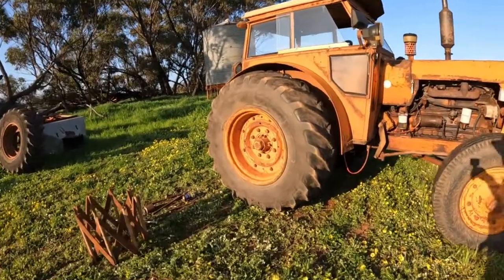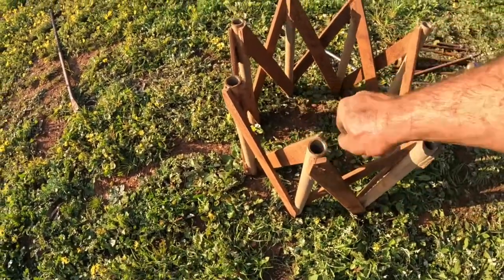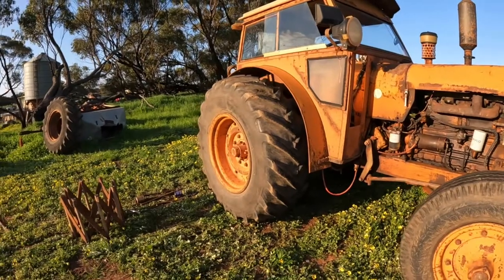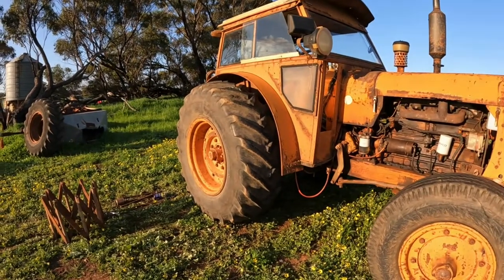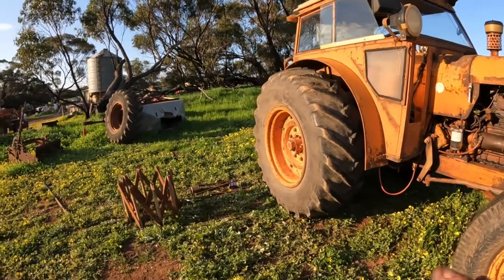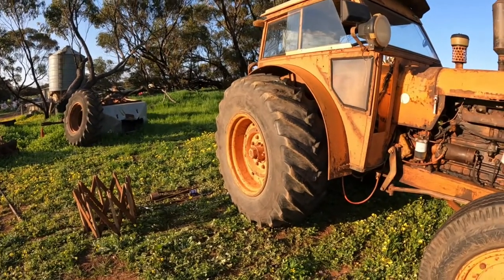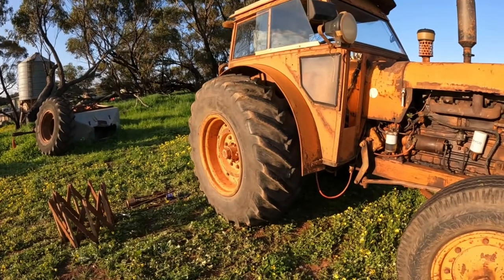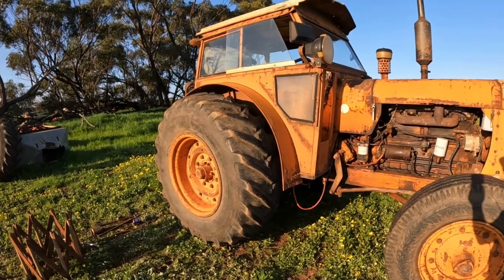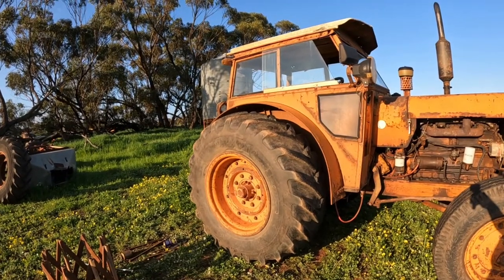So there we have it — the dual wheels are off, and all the short bolts are back in the wheel. Here's the extension frame. Why do we bother taking the dual wheels off? It makes the tractor a lot wider with the dual wheels on — it makes it harder to get through gateways and in and out of the shed. When you're cutting hay you tend to run over a lot more of the hay, because even though your hay mower is swung out away from the tractor, the dual wheels stick out so far that you run over and wreck some of your hay. It also uses less fuel when you take the duals off — not by much, and this isn't a particularly fuel-heavy job, but every little bit helps at the moment. So thanks for watching, I hope you've learned something from this, and I hope to see you again next time. Thanks, bye.